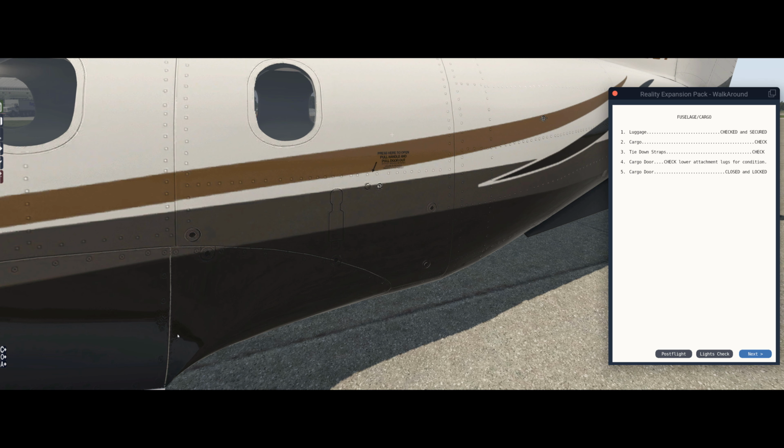And if you're just a little bit low on nitrogen and you take off and you're flying along in the cruise, you might actually see every now and then the red gear in transit lights will flash because the gear is just kind of barely sagging enough to break the micro switch connection and give you a little flash of those red lights. I've seen that happen, if you're kind of on the lower end of the approved range for the nitrogen, you can see that a little bit.